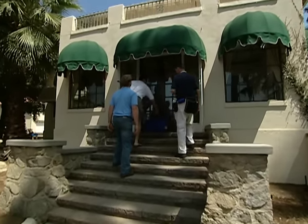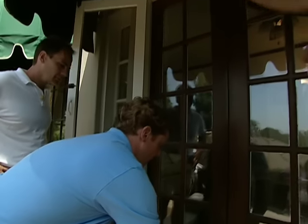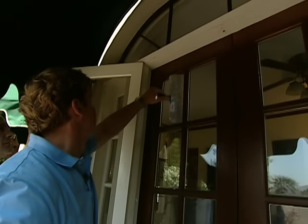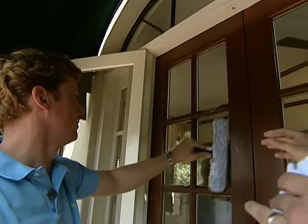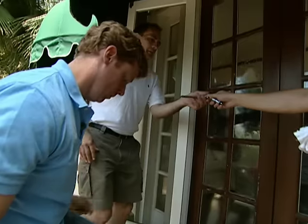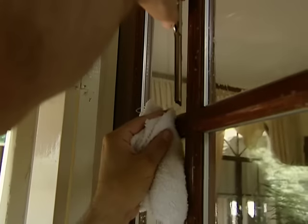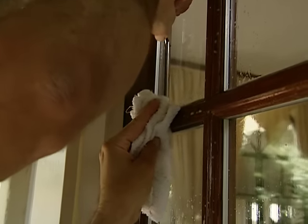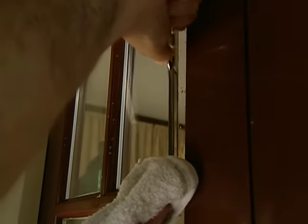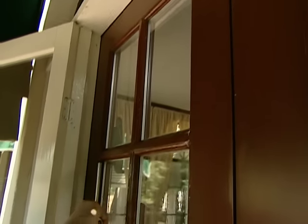These are your typical French window panes, also known as divided lights. I want you to wash these down. It's a lot quicker if you wash them all down at the same time rather than do one each individually. When you do wash them down, you want to make sure you use a little bit of water — less water on the frame — because wood absorbs water. Now take this squeegee and hold that towel underneath the bottom of the squeegee. As you come across, catch the water that's running down the channel of the squeegee. This prevents more water from coming down onto the wood. You want to keep the water off the wood as much as possible, and at the same time you're doing two steps at once — you're squeegeeing the glass and you're wiping the bottom of that frame.